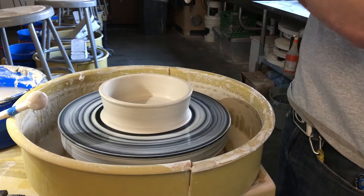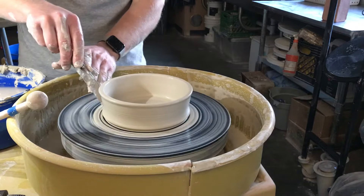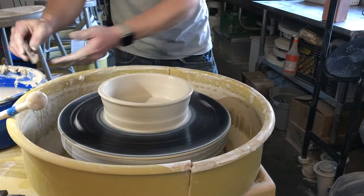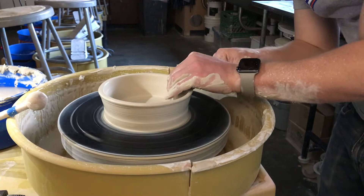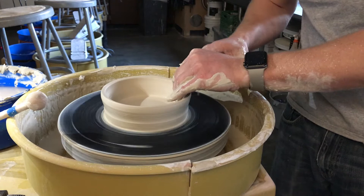So we've pulled. Typically in this case we would go to shape immediately, but we're not. We're going to do our undercut and our pre-trim first, because once we fold these walls down, we're not going to be able to get it. There's your undercut. There's your pre-trim. Then we're going to lay these walls. Actually, I'm going to cut off just a little bit of the rim — do that now before we fold the walls down, it just makes your life easier. And I'm going to round off that edge.